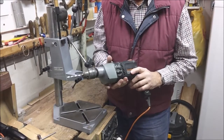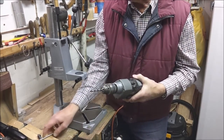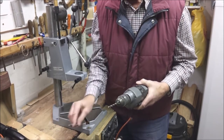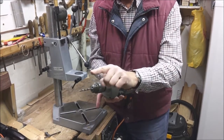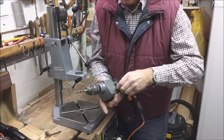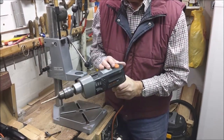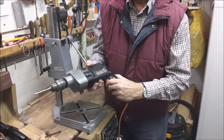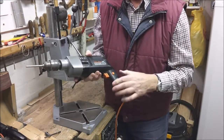The next item I want to show you is this mains operated electric drill. It's many years old and so it's got an old-fashioned chuck on it which needs a chuck key. If you've got a drill like this always know where your chuck key is because you can't improvise with any other tool in your toolbox. I've got a control here that switches the hammer action on or off for drilling into masonry with a special masonry drill bit. I've got a gearbox inside with a control for speed one or speed two. I've also got variable speed control on the trigger. I can lock the trigger on with this button here and press the trigger again to release.